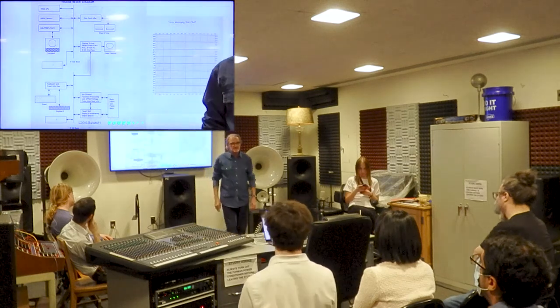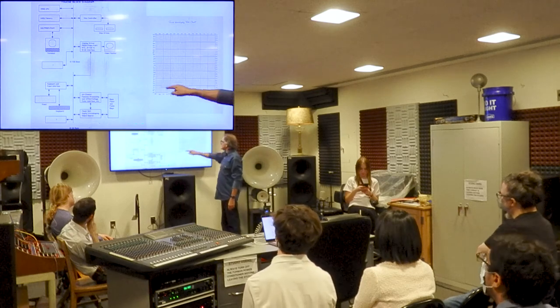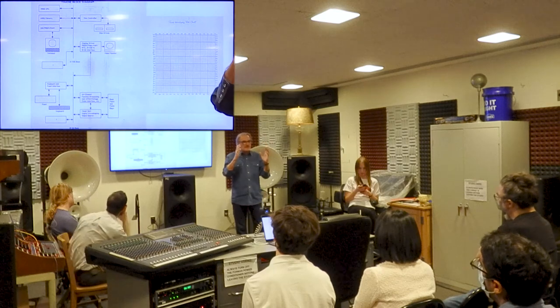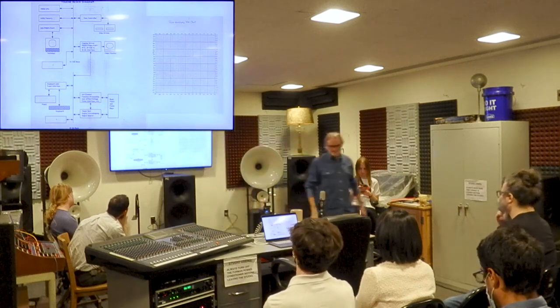And then the Model 360 was the digital wave-shaping signal source. That was the digital oscillator that Don made. So we would actually draw wave-shaping table charts, like that. And that would give us the definition of a certain timbre range, or timbre array, or timbre world. That would then get loaded into the PROMs. You could also load them in from external software on my instrument, and so on. And then that data would go in, and it's brute force hand stuff, right? So 000 to FFF, hexadecimal notation.